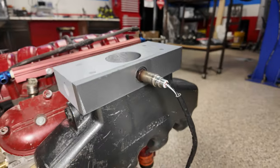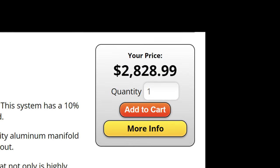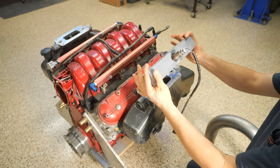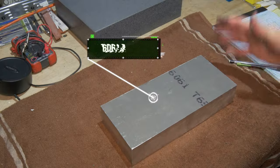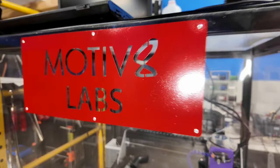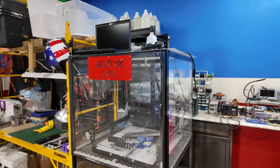There are a few places that make full manifolds with adapters in them and the cheapest ones are like two thousand dollars. So since this is a junkyard jet boat we're gonna try and build this on our own. I've got some aluminum stock that's thick enough to CNC these out of. We're gonna use the old cheapo CNC router — it's one you can buy online today, about a thousand dollars or cheaper. They're meant for wood, like carving cutting boards, but if you run the program slow enough you can cut aluminum. This is gonna be the most work this thing's ever done.